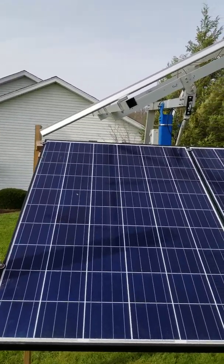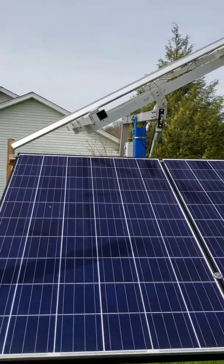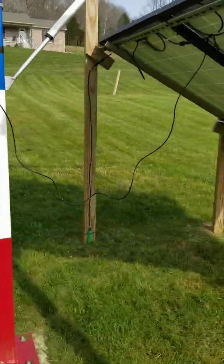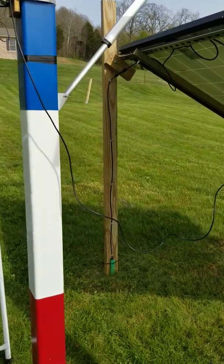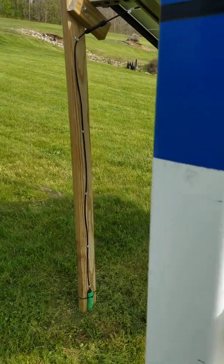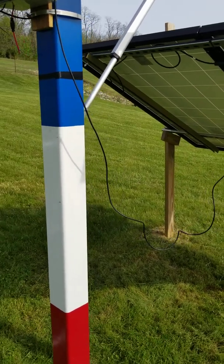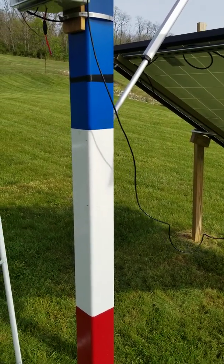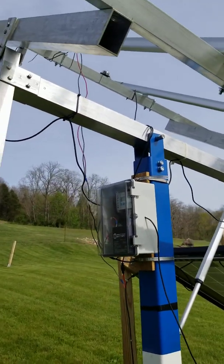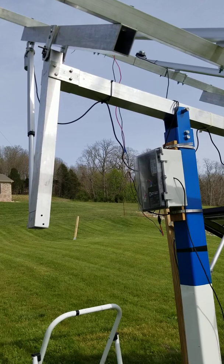So far so good, we're going to let it run. I may have some more tweaking to do. I do have an anemometer that I need to make a mounting plate for, and I'll place it down here — that wire is hanging right there. I'm going to make a plate for down here, probably put it on the back side or maybe this side over here. It will be set up to capture wind speed, and if we start getting high wind speeds, that will cause the controller to level out the panels.